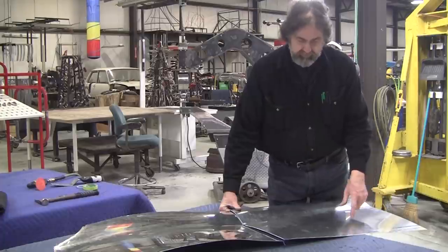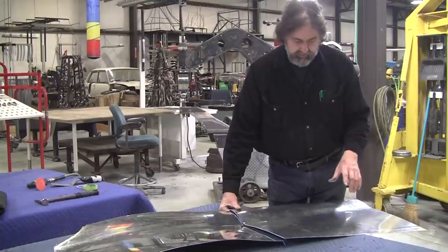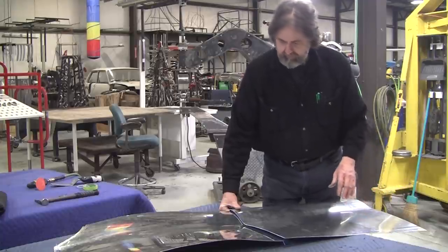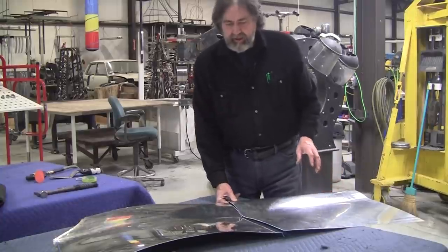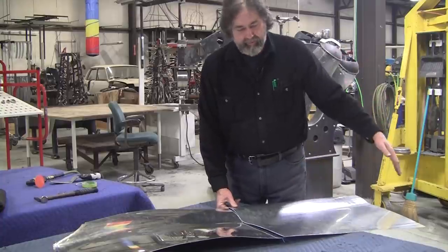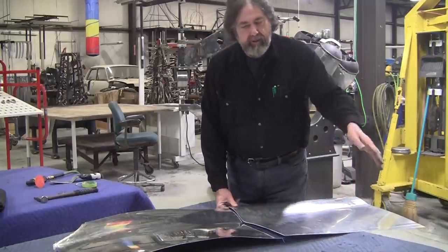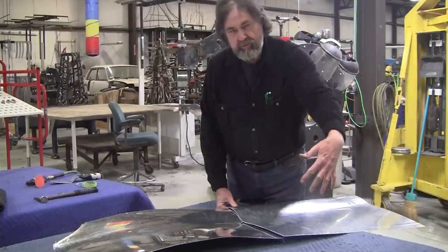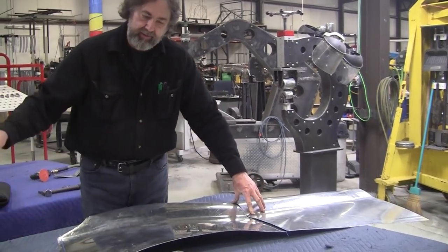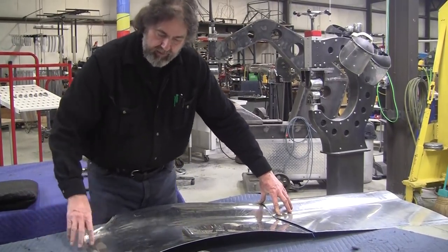And we're going to try to put the louvers in at one point, once we get the 8-inch louver die fine-tuned, and we're confident. So the sequence will be, once I get the pair of these done, this is the right-hand side, I get the left-hand assembly done, then this will get trimmed here, and the center section will get welded to this, and then trimmed on the other side, and the left section will get welded to it. Then we'll have that whole top assembly, except for the front nose piece. And lastly, that will all get trimmed as an assembly and then welded right here.